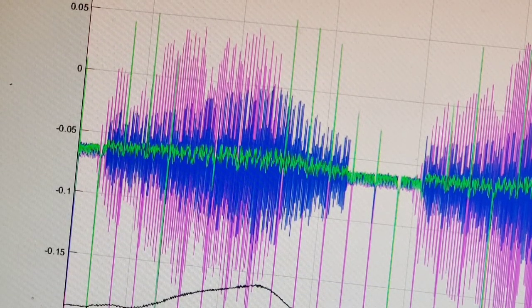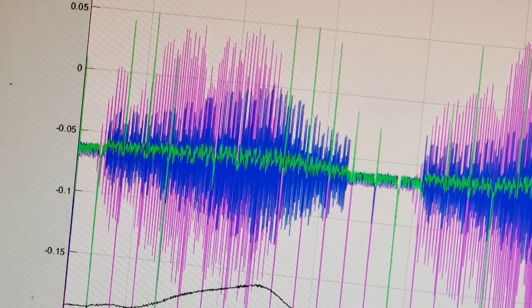We don't have to stop there either. We could also use the overall voltage as a parameter. Then we could also use the current for into the motor, the green signal, to drive something else like a filter cutoff or a pulse width duty cycle or something like an effect like a distortion. There are just numerous possibilities, and that's really only the beginning.